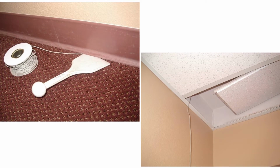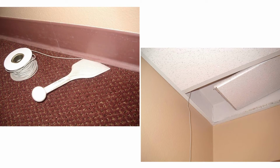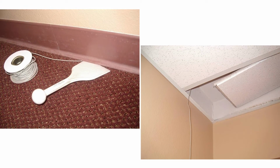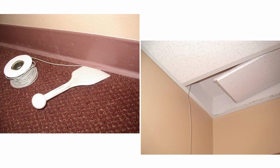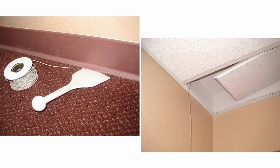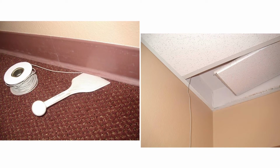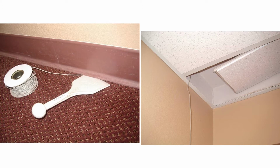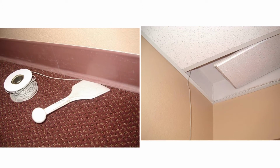Installing the loop antenna can be done in a number of ways. If it is a wire, it can be tucked in between the wall and carpet, under trim, above the ceiling, under the floor, or any other area that allows concealment. Foil or flat wire can be installed below most floor surfaces, but this is much easier before the finished surface is installed.